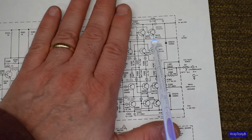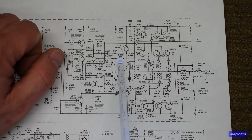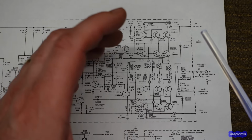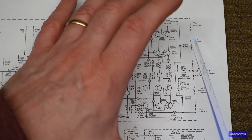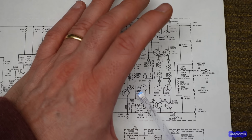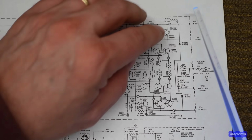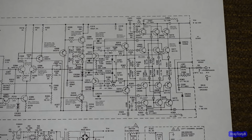This does not do that, though. It's a little bit different. And I would kind of say it's a relative, or I should say an ancestor of a class H amplifier. Class H is where the rail voltage will modulate as needed. So the voltage starts out low and the transistors work. And then more power is required and more amplitude, then the voltage will increase dynamically on the rails, and the transistors will switch to the higher voltage, and it's all kind of a moving target.